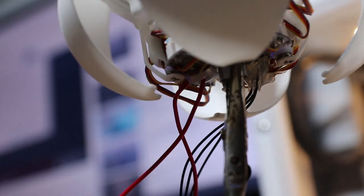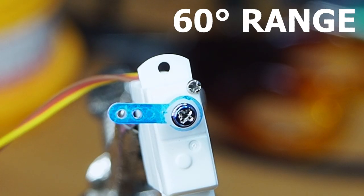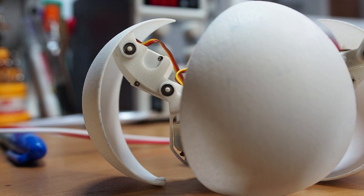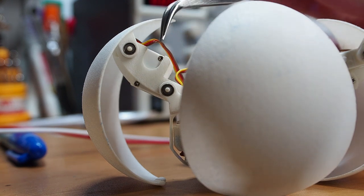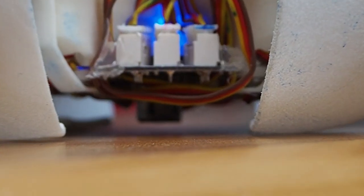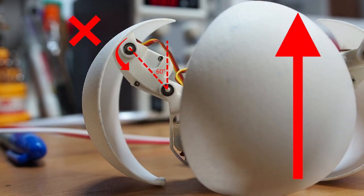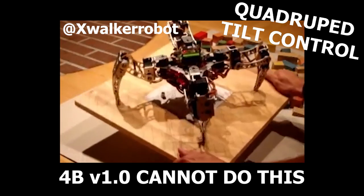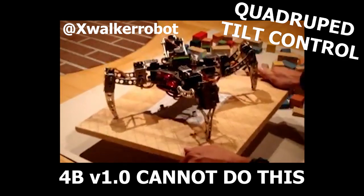This relates to another issue: limiting the robot's kinematic chain. The servos I'm using have a 60-degree angular range, and for the female linkage, all 60 degrees is used just to open and close the sphere. At this angle, the linkage is at its limit, and even though the base is almost hitting the table, it cannot be pushed any higher. This limitation also prevents the robot from compensating the angle of the base.